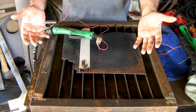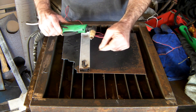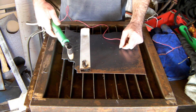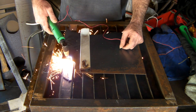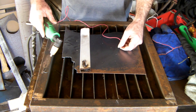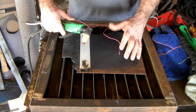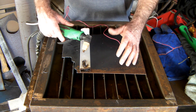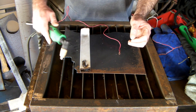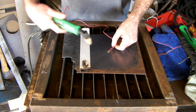See that — huge difference! We'll take the wire off and try again — it doesn't cut. So it cuts with the wire on, doesn't cut without it. If you're working on cars, underneath your car, you've got dirt, rust, trying to cut a bolt that's been there for a hundred years and you just can't get a good earth on it — you need a pilot arc so it blows the crap off and then you can start cutting.